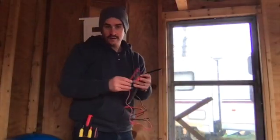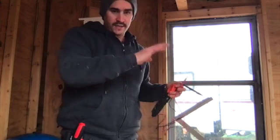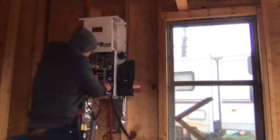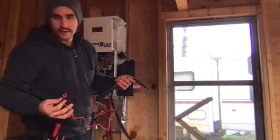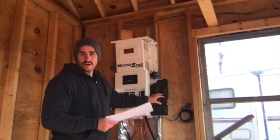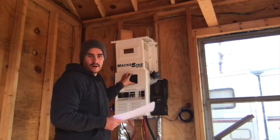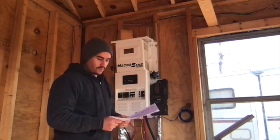All right, guys. So the solar panels are on. I flipped the breakers, checked everything on the combiner box outside. We're getting positive voltage. So a voltage drop of 1.5, which is really great, which is why we had to do the 1 gauge wire so we wouldn't have a large voltage drop. Guys, it's happening. I gotta program my settings in both the charge controller and in the inverter and battery monitor. And so I'll kind of do this in steps and let's just see what happens, all right?